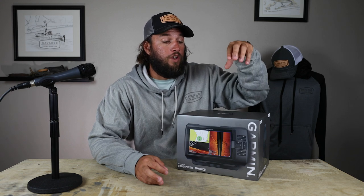This is a pretty cool unit. I'm not going to sit here and read the specs to you; I'll pull it out of the box in a minute. One of the coolest things about this — and I really hated it at first — is a program called Active Captain. Active Captain is an app you can download on your phone and upload GPX files to. Once uploaded to your phone, you connect to the unit's WiFi network and transfer all your waypoints from your phone to the unit. You can also sync all the numbers you find on the water from the unit to your phone. In the evenings, depending on where we're launching, I'll pull out my phone, open Active Captain, zoom in on spots, and measure the distance from point A to point B to plan out how far I'm going to pedal the next morning.